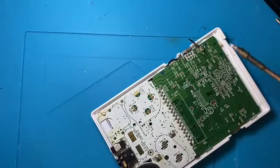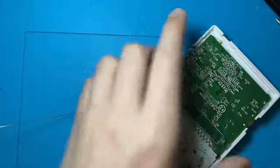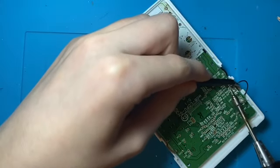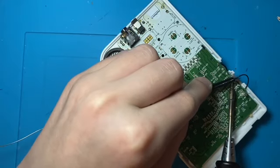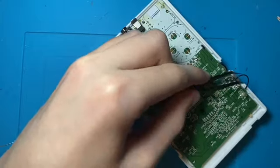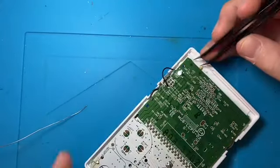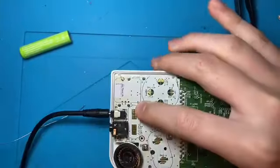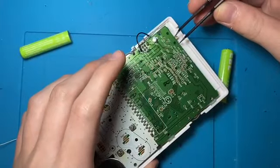So I'm just going to take my soldering iron, get a bit of solder, and just do that. Take the wire with some tweezers because I don't want to burn myself — this is quite small. I can just solder this into place. So obviously I'm going to have to do cable management here and just sort out this cable. But now the power LED lights up when we turn it on. And if we take the batteries out — there is no way it can be getting power from the batteries — when we plug in the DC connector, even without batteries, it still works.